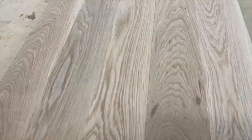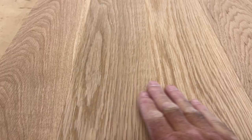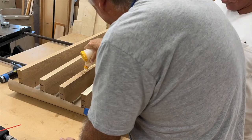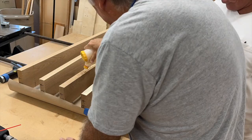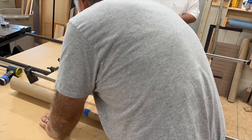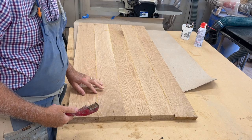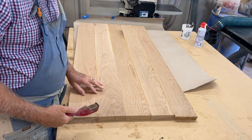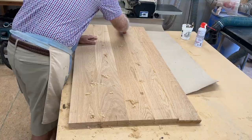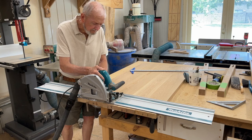Now all of our boards are precisely the same thickness, so any variation is due to our glue-up. Stay with me because we work fast: we put glue on the edges and smear it out, fold the edges together, get clamps on the edges and squeeze, add clamps underneath, put a caul on top, clamp that in, put more clamps on, then scrape the glue off to remove excess. After the glue-up we come in with our scraper to scrape the drips off, then square up the table by trimming the edges perpendicular.